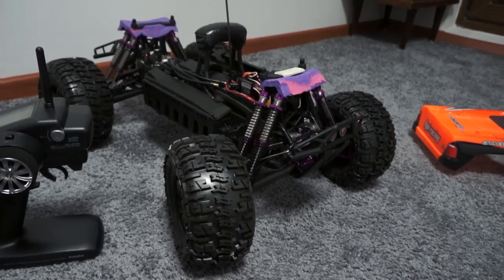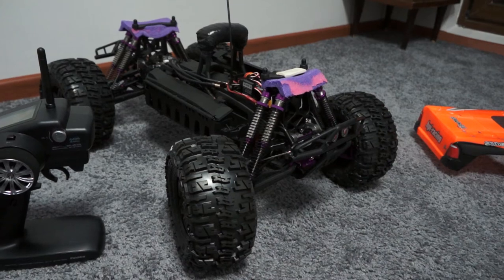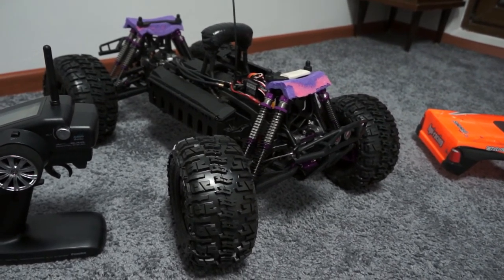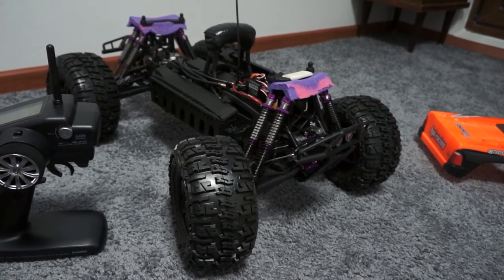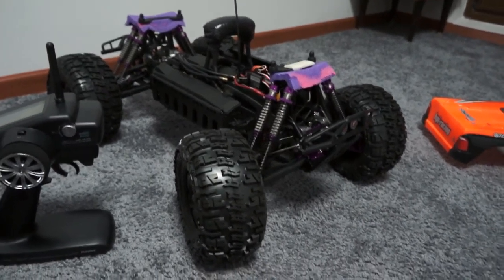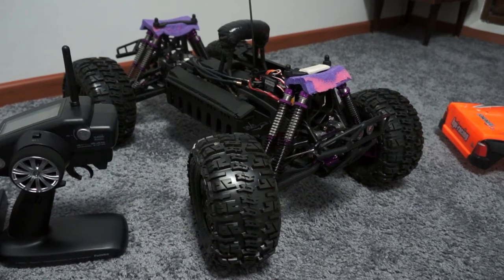So in total, between me and my nephew, we have right now three dead Blue ESCs. And that just doesn't make any sense, does it? Different motors, different batteries are used, and the symptoms are exactly the same. Only one of them burned with flames, where two of them just died silently. A little smoke, and then the smoke just stops, and when you flip the switch the car just doesn't turn on. You don't have the standard sounds, no lights on the speed controller, just simply dead.